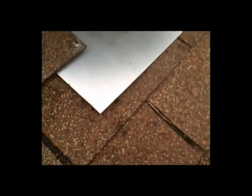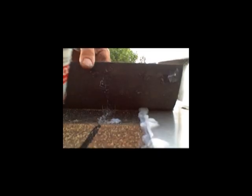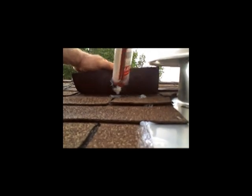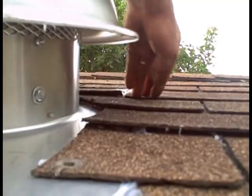I'm showing how I made the bottom of the shingles parallel with the bottom of the fan. I should have left a little more metal exposed to the weather there — about five inches is perfect, so you have one full course of metal exposed to the weather at the bottom. I'm caulking the nail heads here. One thing to keep in mind: never caulk the bottom of the flashing underneath it — let water get out. I'm just caulking the sides to stop wind from blowing rain up sideways under there, and caulking the shingles to make sure the wind does not blow them up or off. With silicone you have to press it down while it's still soft before it starts to harden — make sure it stays stuck down tight.